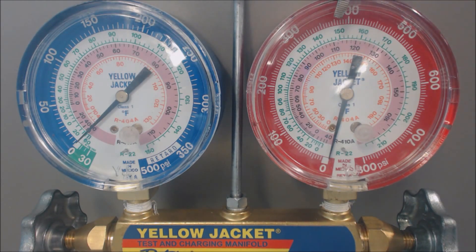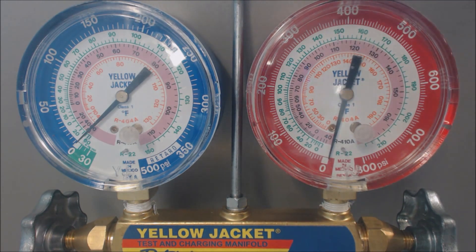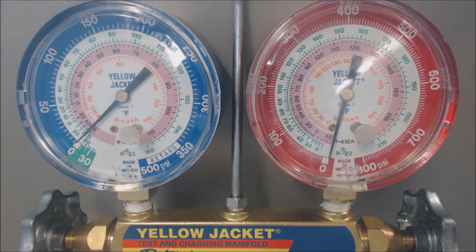You can actually figure out a compression ratio by taking the high-side pressure in psig divided by the evaporator coil psig. The higher that ratio is, the less efficient the unit is. So you want your liquid pressure lower for better efficiency, but you want to make sure it's high enough to get your proper sub-cooling rating if the unit is equipped with a TXV.